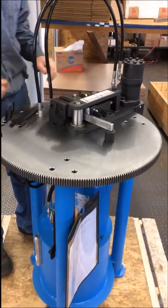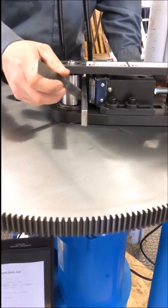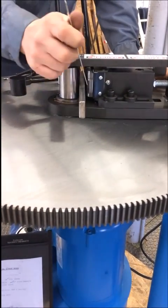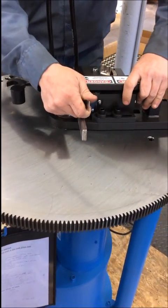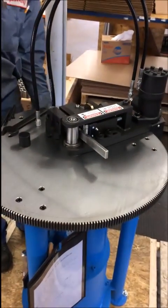What you want to do is take a 6 inch measuring scale, place it in between your die post and your specimen. And then on your vise roller you want to have a little bit of clearance — about the thickness of that scale. Then we're just going to turn it on.